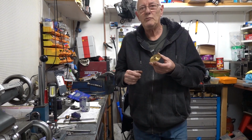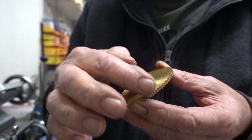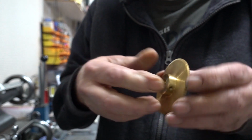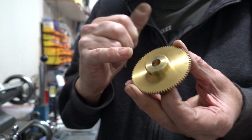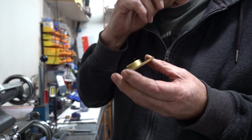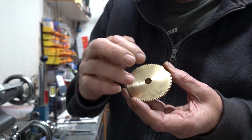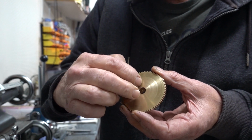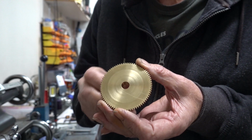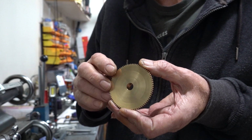Right, so I was talking about machining a camshaft on here, and then I decided not, because it could be up to 4.5 degrees out in any tooth direction. So I wanted a cam that would rotate, and I talked about taking away all this material, but that there could be wobble in it. My plan was to make a cam, and in here cut 2 holes and slot them so that I could fit the cam with 2 screws, and rotate the cam through quite a few degrees. So with that adjustment I could get exactly what I wanted.